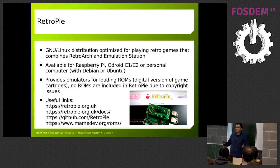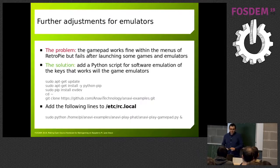Those of you who have a Raspberry Pi can visit RetroPie, download it, find interesting ROMs, and play retro games. The problem with RetroPie that I experienced — despite all the things I did with the Device Tree binary overlay — is that some emulators were not working. The buttons worked within the menus provided by EmulationStation and RetroPie, but I had a problem playing within some particular emulators. So what I did was hack a simple Python script that converts the button clicks into signals that can be processed by the emulators. The steps are open source — here's how to get it working if you're creating a similar board.